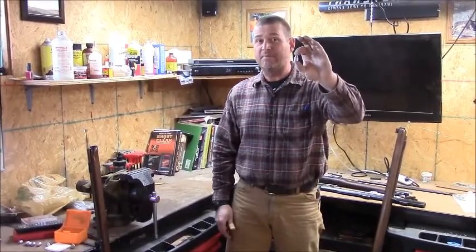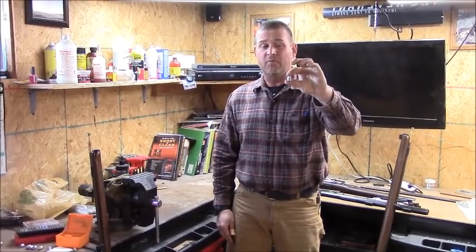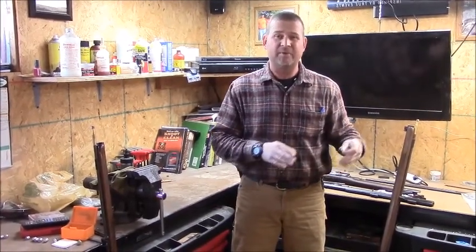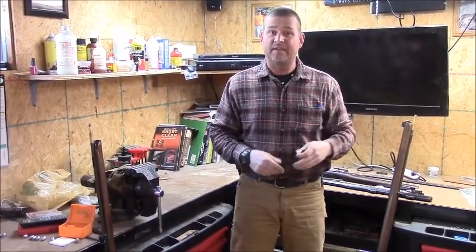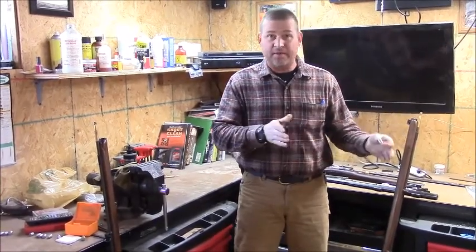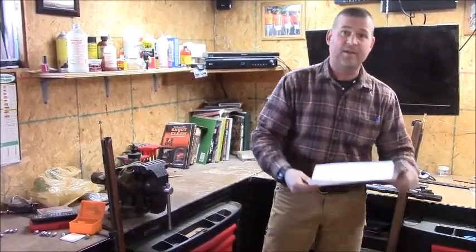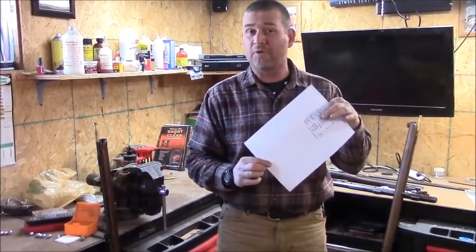We were doing some ballistics testing of one of the new bullets we're making for our precision long rifles. This is a .58 caliber mini ball, which means it has a hollow base — it's a semi-wad cutter design. We want to calculate its ballistic coefficient. We set up chronographs at different locations, take the velocity reading at the muzzle, compare that to the velocity at 50 yards, and plug it into a computer along with the weather and atmospheric data. And the final results are in — the ballistics coefficient of that bullet is .146.